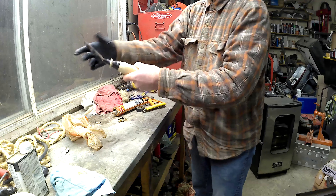I did three coats. I left it about five hours between the first and second coats, and the third coat was done the next day. It's a nice easy product to use if you're doing anything interior-based. Since it's so thin it dries fast — that helps keep the dust, bugs, and runs at bay. That's the main benefit to the wipe-on poly versus the regular.